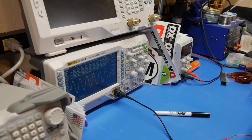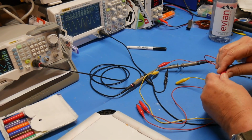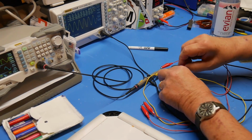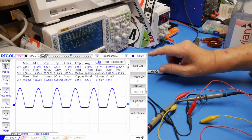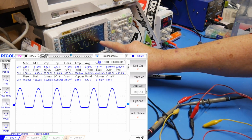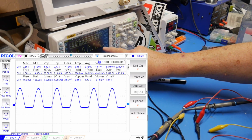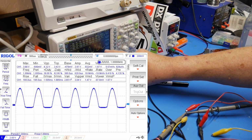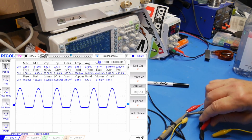Now, I have all these diodes here. I have this diode, and watch what happens. I'm going to connect this up. These are the two diodes. They're very tiny. And I'm going to connect this right here, and you'll notice that there's clipping. See, the bottom part is clipped off because here we see the T is the trigger. That's 0 volts. We're down here a little bit below that where we have minus 0.7 volts.